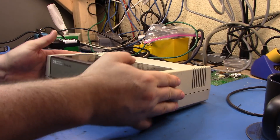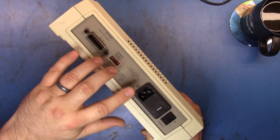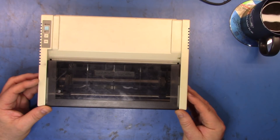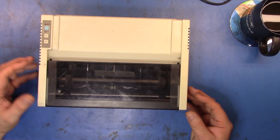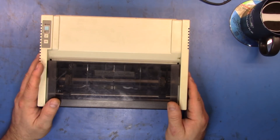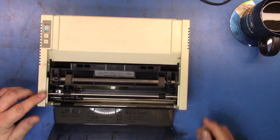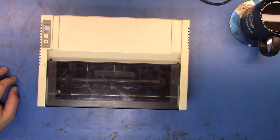To do that, I went and bought this guy here, which is the 2225A — a GPIB-based ThinkJet printer. I only paid about $25 or $30 for it, and it was local so the shipping was minimal. I got it, plugged it in, tested it, did the print test. I didn't have a print cartridge, but the paper moved and the head moved back and forth. I thought I had a winner. So I went and bought a printer cartridge and some tractor feed paper — all old school — but when I put it all together and tried to print, nothing.